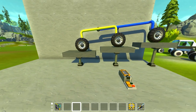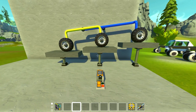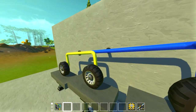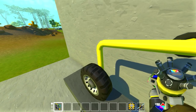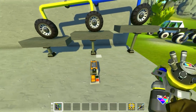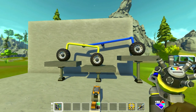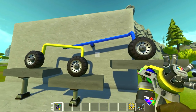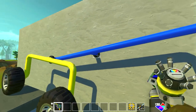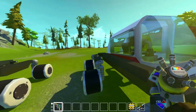The real Mars rovers - the ones that are just driving around on Mars - they actually use this type of suspension. There's a few different reasons to use it, one being that there's no actual springs involved. Each wheel is just attached on a rigid arm with a couple of bearings. As you change the elevation, the bogie on the back will adjust and the rocker can adjust independently, and then this little bearing point here would go to the chassis.